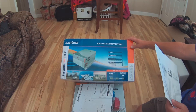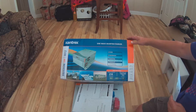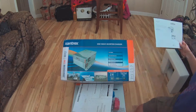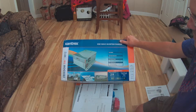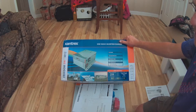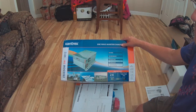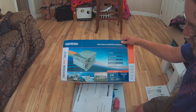There are a couple more things I wanted to go over fairly quickly. The Xantrex 3000, the 3012, and also the 2000 unit is pure sine wave. The pure sine wave essentially mirrors the 60 hertz that you find in your home, which all of your devices will like. If it isn't a pure sine wave inverter, you run a chance of burning out or overheating your electronics — especially power supplies, battery chargers, those types of things. And if you have an electronic clock, that's just not going to work because it's looking for that 60 hertz, and a non-pure sine wave inverter will not give you that.